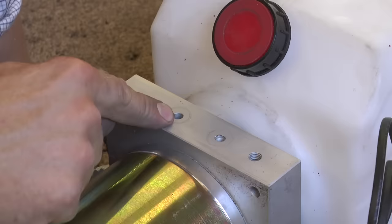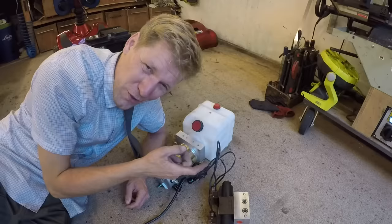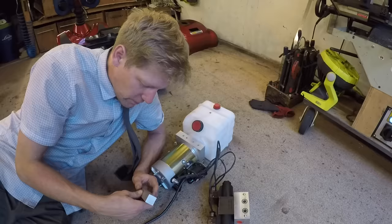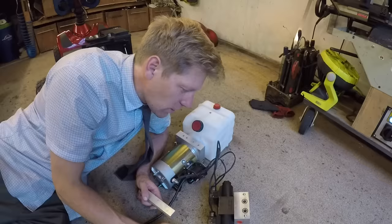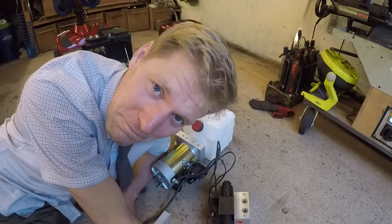I've got the solenoid valves off and there's basically just two holes. I thought about just drilling and tapping those holes, but all the swarf would drop in and that's no good. So instead I've got a block-off plate - we'll put that on top, drill the holes for it to bolt down, then put some threads and taps to get fittings off that. I've got to put these little o-rings into little grooved slots, so I bought a rotary table and I'll have a go at machining them out. It might not work, but I'm not an engineer - I just buy tools and try and use them.